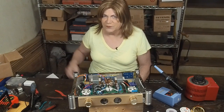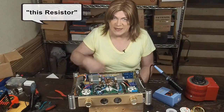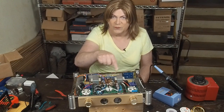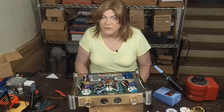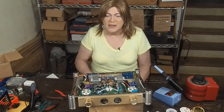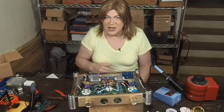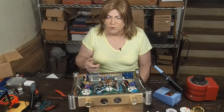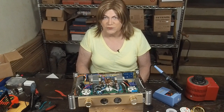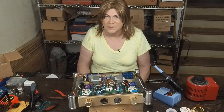There's almost no difference in the ripple with this in place and not. Even with this RC network before the chokes, there's 45 volts of ripple before the first choke. So taking this resistor out changes nothing at the ripple of the B plus as it comes out of that 330 UF cap before it goes to the tube boards.